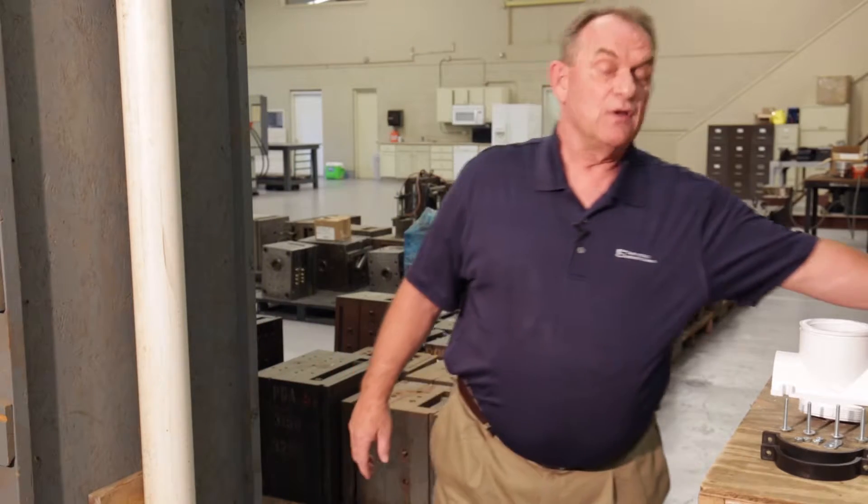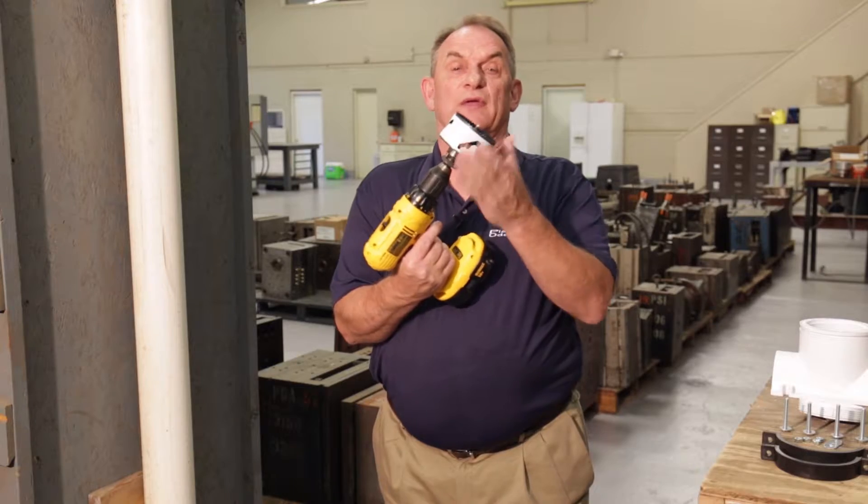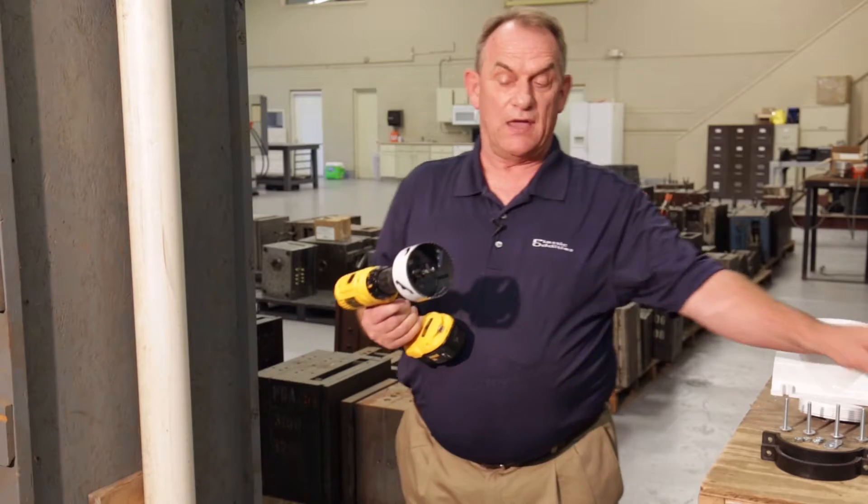Say I'm in a 10-story building. I've got one clean-out down on the bottom story, I've got another clean-out up above me. I need one right here. Let me show you. All you need is a drill, a hole saw — this one has a 3½-inch hole saw — a 7/16-inch socket, and the kit.